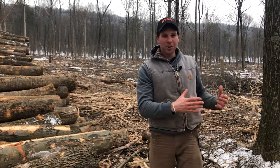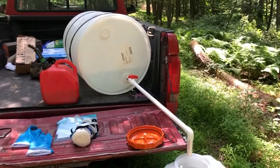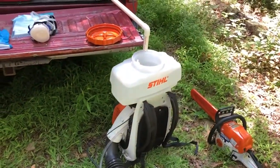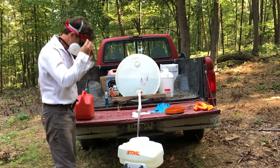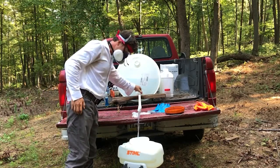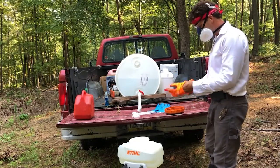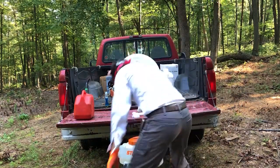Because I don't live near this property, I needed my spray equipment to be mobile. I used a 55-gallon barrel for my water supply, and once I made it to the location, I attached a PVC tube with a valve to control the flow. Using a mist blower, I mixed a 2% glyphosate solution into the 4-gallon tank. I originally wore a disposable suit, but it didn't work well for me. I made sure the clothes I wore were only used for spraying, and I had a change of clothes when done. An old dress shirt with thin fabric and long sleeves was helpful, and I bought the lightest pair of hiking shoes and put knee-high rubber boots over them, which certainly helped on those long afternoons in the woods.